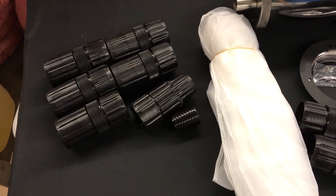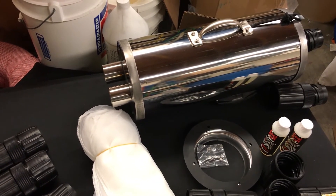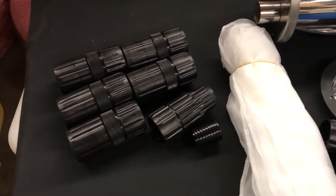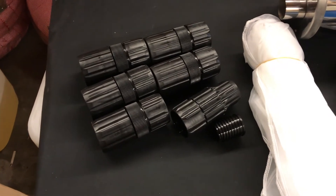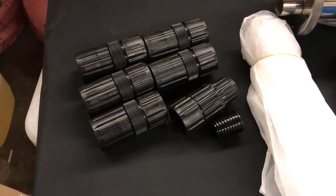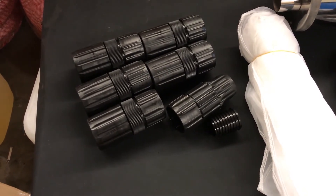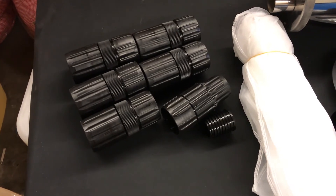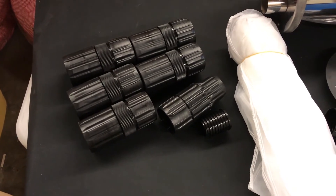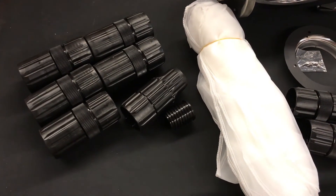The best we've got is dual 2-inch hoses, a la the silver bullet — you can't get any better than that, it doesn't cut down on suction hardly at all. Next best is a single 2.5-inch. Next is a single 2-inch, which isn't really that good — and that's what the industry's based on, 2-inch hose, and it's not very good. 1.5-inch is even worse. All of the CFM testing we did years ago confirms all of this. Dual 2s is best, single 2.5 second, 2-inch not that good, 1.5-inch awful. 1.5-inch always showed up at the bottom of the list when we sorted on CFMs for a given hose run — it always came in dead last.